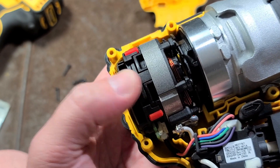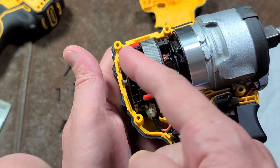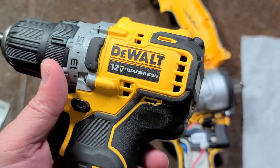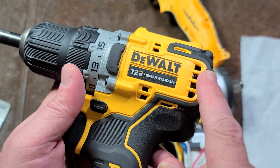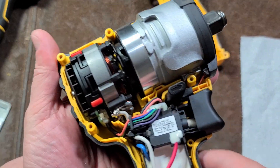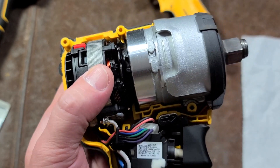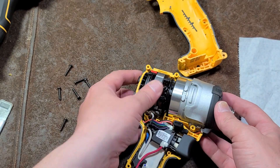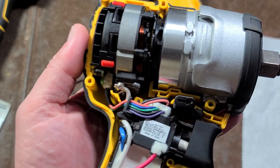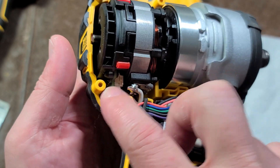There are little rubber bumpers to help prevent the motor from rattling around. It is a back-fan unit, which is interesting — the impacts suck air into the middle of the tool and blow it out the back, which is unconventional, whereas their brushless drills are conventional. The fan pulls in air through the back and blows it out through the middle of the tool, just like corded tools. This series of wires are for the Hall effect sensors — the magnetic sensors that sense the motor position. It helps with low-speed torque. There's also a little area here where the wires go for the light ring. All the wires are either soldered or, like on the Hall effect sensors, that connector is actually glued into the motor — very difficult to remove.